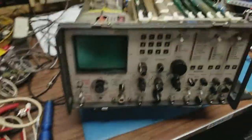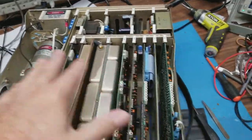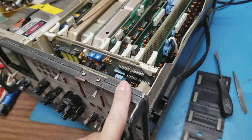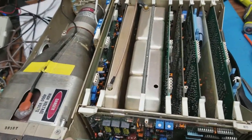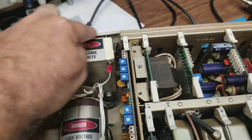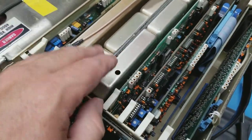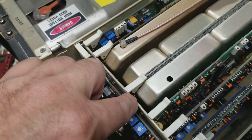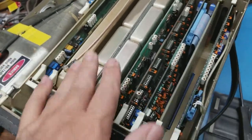This is the correct service manual for this model — the D-series later model is different as far as power supplies and sections. This one has trunking and cellular support but doesn't have the one option. Some back history: this thing had shipping damage in the past — dropped or whatever. As we can see in the back, one rail for the A9 card (the synthesizer) is a little wonky — two pop rivets broke off from the channel and they're held in by a small pin right now.